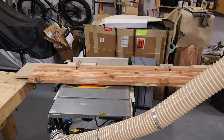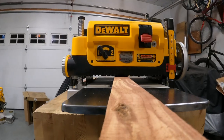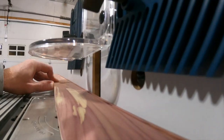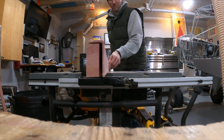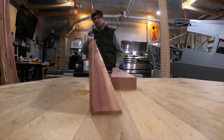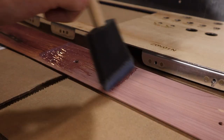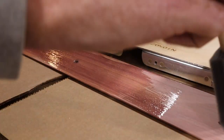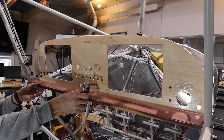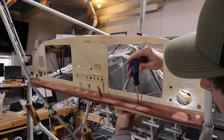For the angled portion at the top of the panel, I made a trim piece. A lot of directions I could have went here, and I'm sure this was probably the silliest option, but I think it ties the panel together with the stick grips nicely. The veneer on the top and the trim piece were both finished with polyurethane. I used a water-based poly because I don't like how oil-based polys yellow maple over time. After the finish was dry, I put the panel in place. The trim piece is held on with the same screws the panel is attached at the base with.